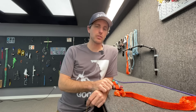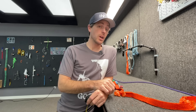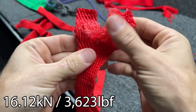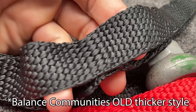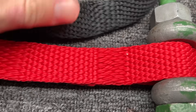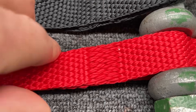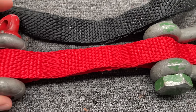Standards are behind a paywall. Unless you're an expert, you don't know how they're getting these numbers — and then you go to use it and you're not getting those numbers. For comparison, let's break test the Balanced Community version two more times, since I've already done it once on the thicker material, and see if we consistently get in the 16 kilonewton range — which would be about 4 or 5 kilonewtons lower than the stuff that looks identical. This is the Balanced Community webbing, and this is RSI. You can compare the two — the only difference I could find is a longer weave on the RSI where the two layers combine, and I think that's probably why we're getting a strength difference.